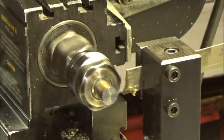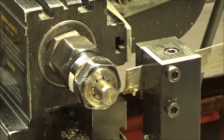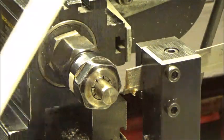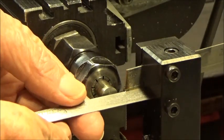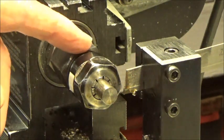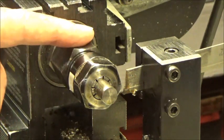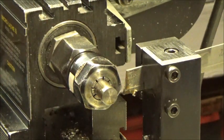That explanation seems correct. The blade is sticking out pretty close to a half an inch, so what I'm going to do is find a piece of three-quarter inch material — that's about as big as it'll be able to cut off. I'll have to mount the four-jaw chuck to do that, so I'll shut the camera and bring you back in a second.